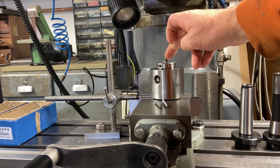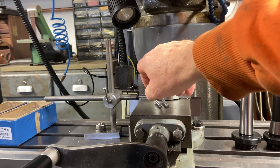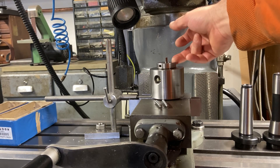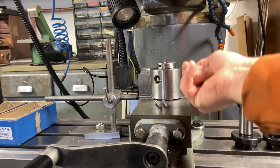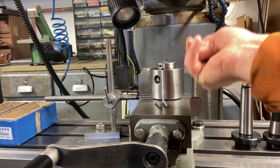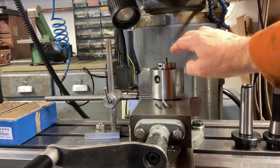I've already set the tool to the correct height. There's a sleeve in there which I can lock down with a key in the side, and I'm going to put another one on the other side to hold the collet. Underneath it there's an M8 grub screw which I can adjust to set the height of the tool, because it obviously needs to be at the correct height for it to work.